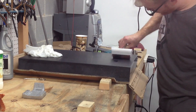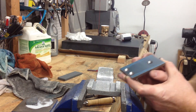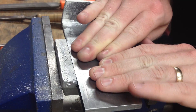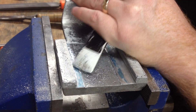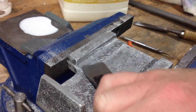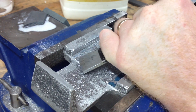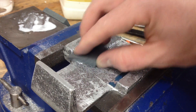I smear oil paint onto a reference surface. In this case, I use a roller to transfer that paint to the compound ways, and then I can see the high spots. The high spots are marked with blue paint, and they let me know where I should focus my attention with the scraper. I go through and iteratively knock down the high spots. When you're scraping, you leave behind little burrs, so you need to use a stone to knock down those burrs. That way, the next time you transfer, your part is resting only on the high spots, not the burrs. This process is pretty iterative, where you slowly scrape down the high spots until the part approaches the reference surface.